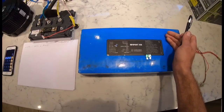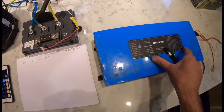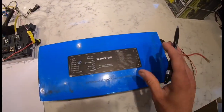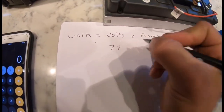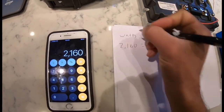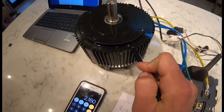Let's use the battery I was using for our bench test. It did make the motor move and work. But if we take this battery and put it into the formula — it's a 72-volt battery, limited by a 30-amp fuse on the main power feed. We can't get anything more than 30 amps out of it, because all it's going to do is pop that fuse. So, 72 volts times 30 amps gives us 2,160 watts. That is nowhere near the 5,000 watts this motor is going to produce.